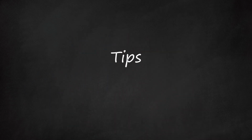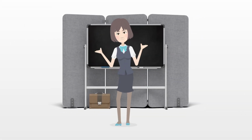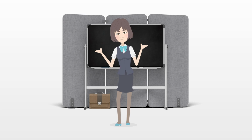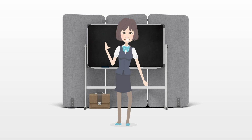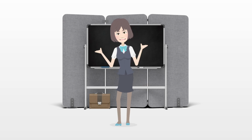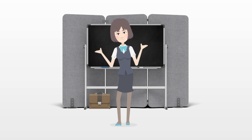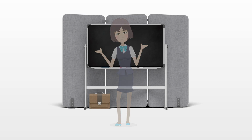Tips. Be sure to seal the top and bottom of exterior doors. This helps to encase the wood for minimum swelling on rainy days. Use a lint-free cloth to wipe down the door between sandings. It is best to use a sanding sealer to ensure an even staining and prevent blotching. Acquire a piece of wood of similar grain and type that the door is made of. Apply the chosen stain to small areas until you see the desired results. It is better to make mistakes here than on the door.